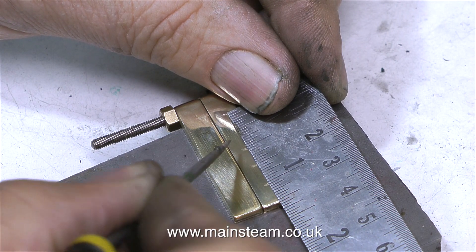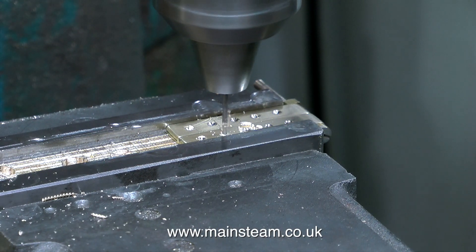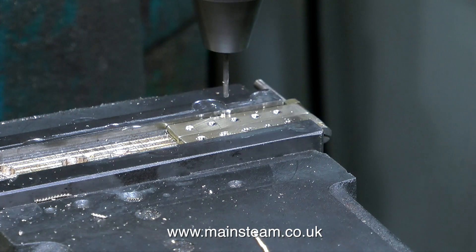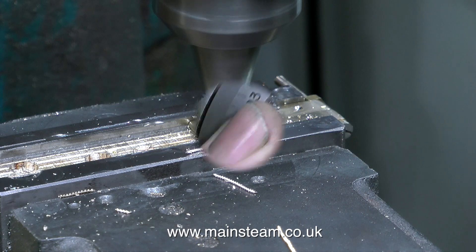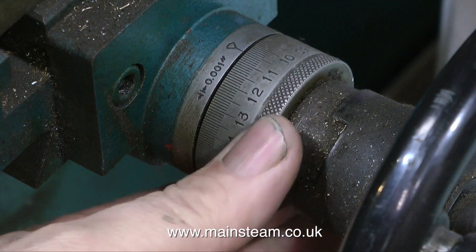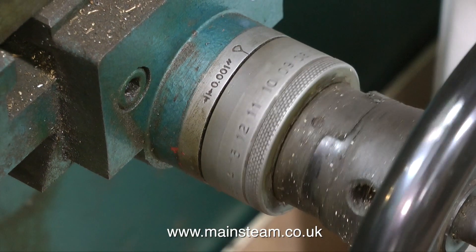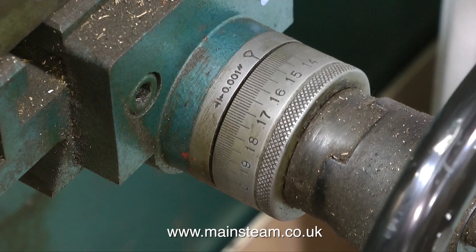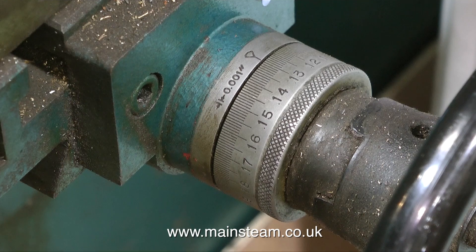And now I'm drilling the holes — it's speeded up to save some time, and I've already spotted the holes with a centre drill. I did not do this freehand — I used the machine. On the end of the machine is a wheel, and mounted on the same shaft is a dial that you can reset. I'm looking for zero. What you can't see is that as I set the dial to zero, the centre drill on the hinge was exactly on one of the marks. Now I'm rotating the hand wheel — not the dial — watching the centre drill, and when it's over the next mark, I know that's the correct distance I need.